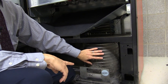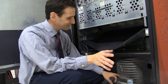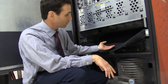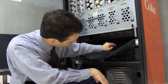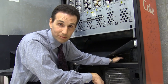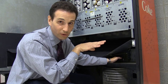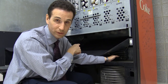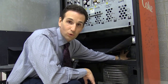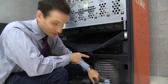It clicked on and then just clicked off again. When you hear that type of clicking from your compressor in the back, it's usually a sign that it's dead. There is a fan in there that's running, so the fan is good. There's also the evaporator fan up top which blows air through the evaporator coils — the coils that get cold and make the cabinet cold. That fan runs almost all the time, and if it broke you'd probably see ice all over your evaporator coils.